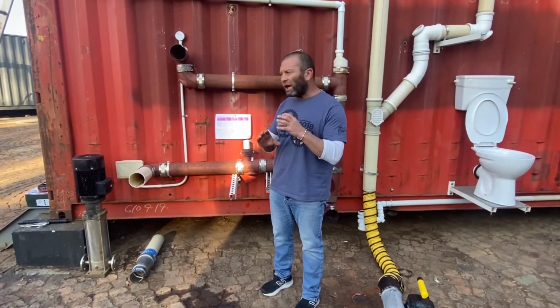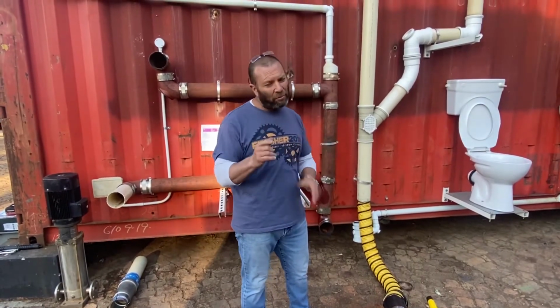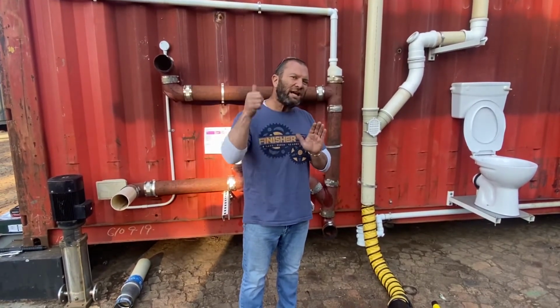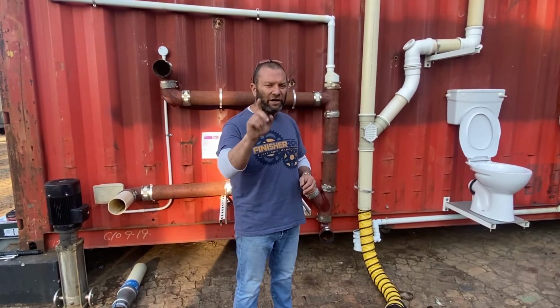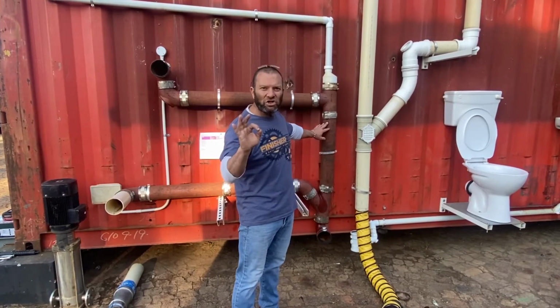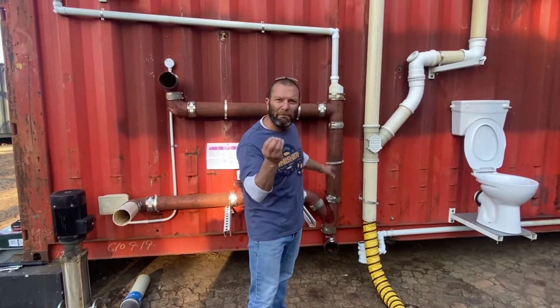First of all, you clean the pipe thoroughly. So if you're going to put a structural liner in, you don't have to clean it as much as you would have to clean it with a spray lining or brush coating. So please, you must insist on the protocols of your lining company and say, guys, may I please get a certificate of your quality control, and on what are you basing your 10-year warranty? I've seen guys give 20-year warranties. If you're going to give a 20-year warranty, make very sure that you've got a proper anchor tooth and the hygrometry, the moisture content was out, and the guys actually put sensors at the top and the bottom, and they actually measured how much moisture.